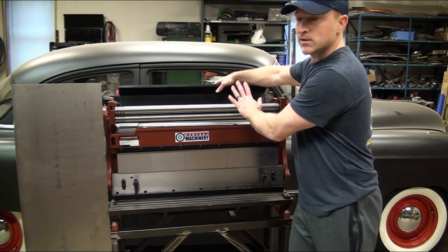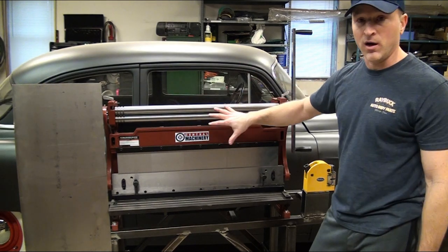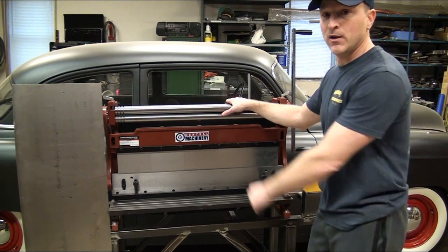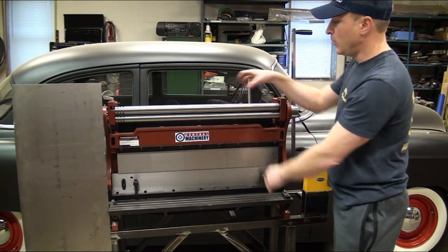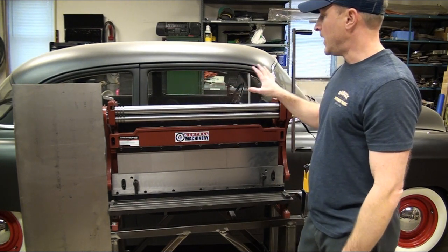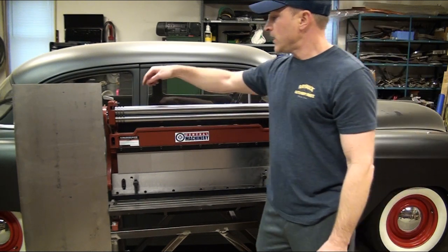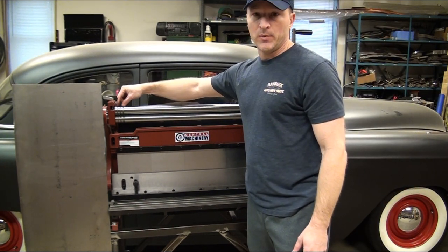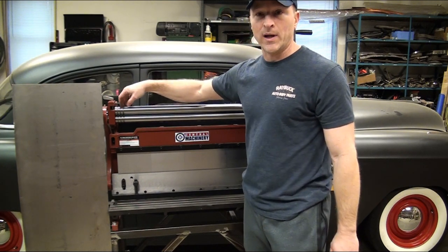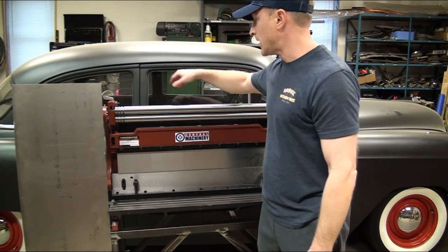On the top is the slip roll. There's a cover on it — keep the cover on when using the other two pieces, because if your hand is up there and you're pulling the lever down, you don't want your fingers getting pinched. When you're using the slip roll, you pull the cover up. It'll do 20-gauge steel or 18-gauge aluminum. It also has three grooves on the very end in three different sizes so you can do round stock — for decorative curved or bent work.